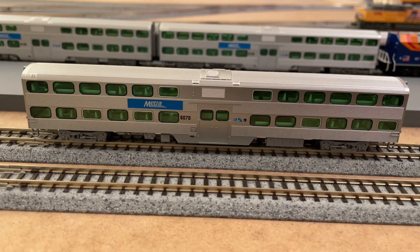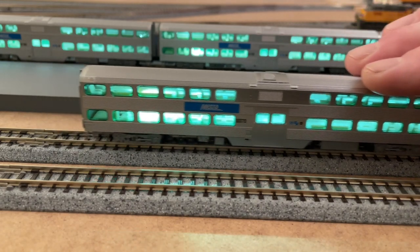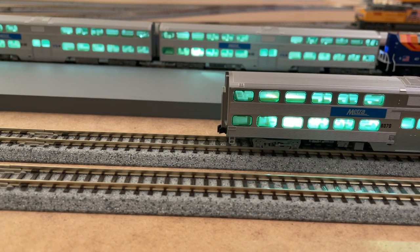I've put the two halves back together, making sure the arrows were pointing the same way before clipping them together so they're the right way around. Reapplying the track power - and you can immediately see that the color of this one is exactly the same as the color on the other ones. So I was right not to fit that orange lens. Applying an orange filter to a white LED would just give you an orange tinted light, and they are exactly the same - really happy with that.